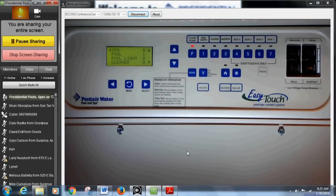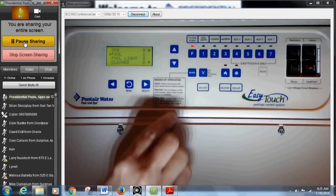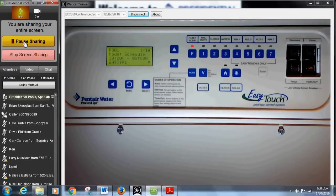Under 'Pool' you'll see the number 1, and under 'Cleaner' you'll also see a number. Remember: Pool represents low speed, Cleaner represents high speed. Scroll down to 'Pool' for low speed and press select. You'll see it says '1 of 1' — you only need one schedule. If it says '2 of 2' or more, you've accidentally added extra schedules. I've seen pools with 9 of 9 where the pump was cycling on and off — it's because multiple schedules were added.